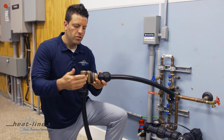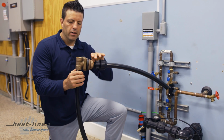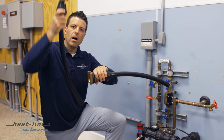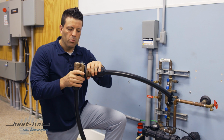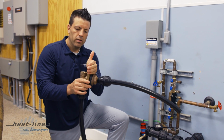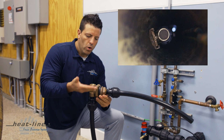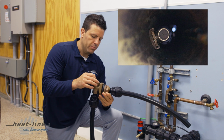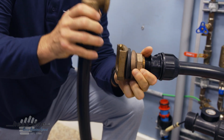And what this allows you to do is interface with the well, and it also slips apart to allow you to pull the pipe up the well casing. So obviously, if you can imagine here, the outer well casing is right about in this vicinity. And the reason why it's important to measure accurately to a pitless adapter in a well is really due to that sliding apart and coming up.